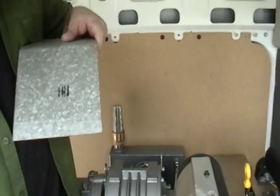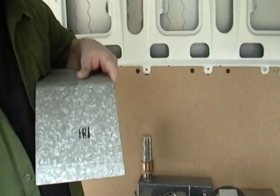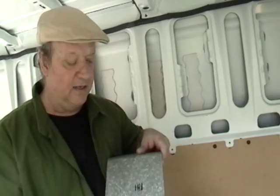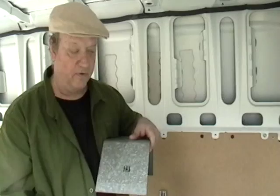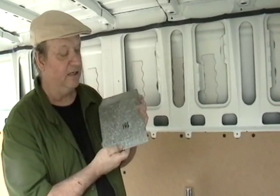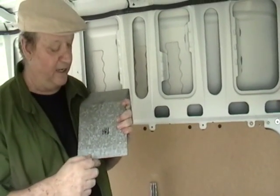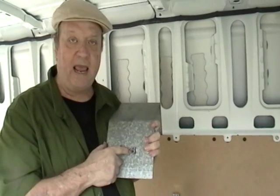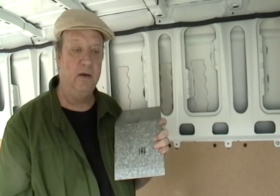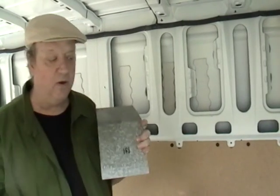So this machine, while cleaning, operates at right at 40% load off this engine. That leaves us a 60% reserve. Now that takes in consideration for high altitude. So we've got a 60% horsepower reserve in this engine under operating conditions. Then we took it at full 16 inches of mercury, and it was just a little past 50%, so we probably had a 40% reserve horsepower under full load, but truck mounts don't operate under full load.